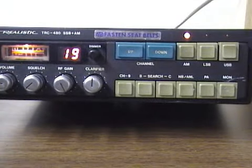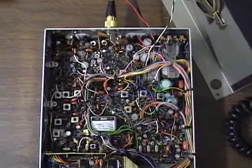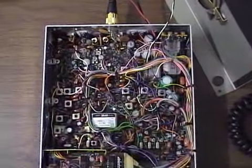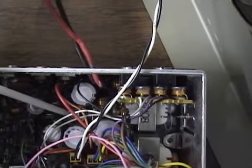As you can see, this radio does have a sticker on the front — that's obviously not stock. We will take off the bottom case and I'll show you a couple of adjustment points real quick. We removed the bottom cover. As you can see on the right-hand side there's a hole in the cover, and you do have to remove the microphone before you take off the bottom cover of the radio.